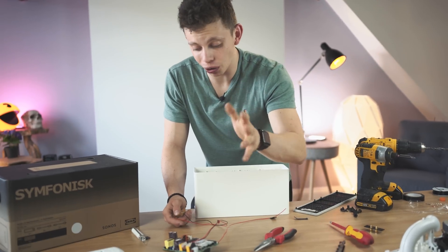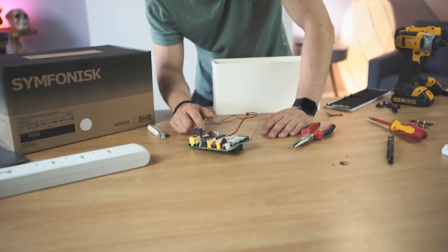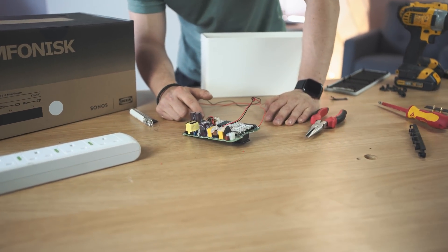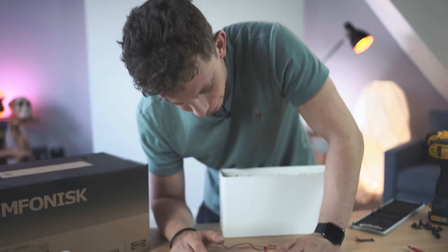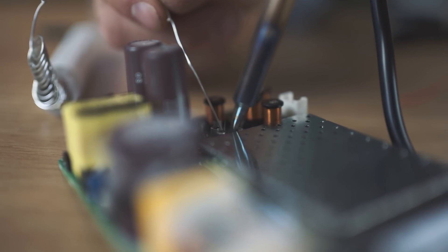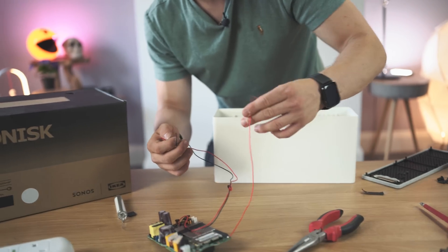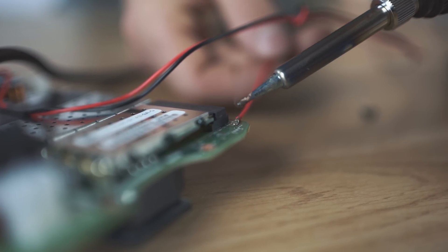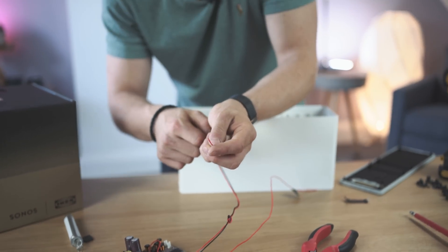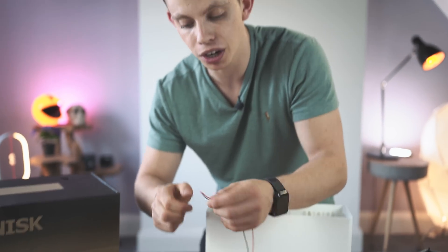Soldering — hardest part — all out of the way. Probably this isn't going to work, to be perfectly honest with you, because if you look down here where I've actually had to solder, it's so, so small. The guide I'm following — which I've put in the description — he's zoomed in and I thought these were a hell of a lot bigger than they are. But if this works, it's going to be amazing. This is our low frequency and our high frequency, and then we also have another cable soldered to the board — this is just our ground. Essentially, these are going to be connected together and the inbuilt crossover is going to take care of that; we're just going to combine the low and high frequencies together.